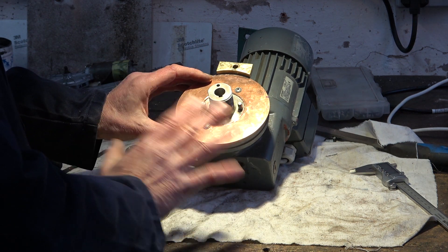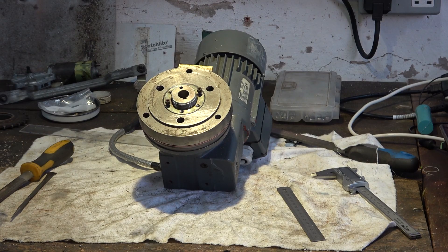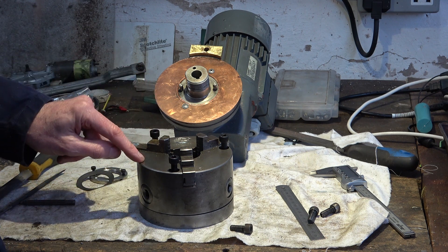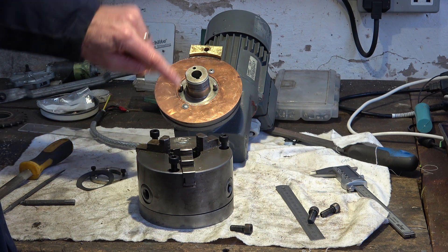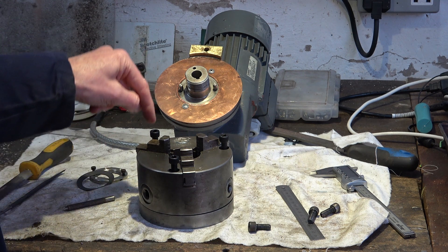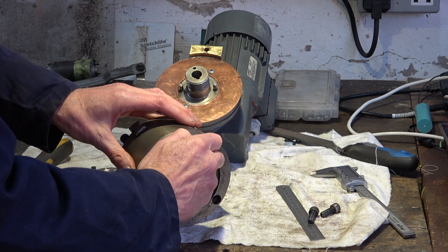That's all now locked together, but I'll assemble it fully later on. The back plate goes on and should clear these two screws — which it does. Time to fix the chuck on. I've got some new cap head screws for this, 75mm long, 8x1.25mm. I've lined up the chuck and the back plate with the two dots, so this jaw is going to be opposite this hole. I'll put these three old screws in the back to clamp the two together before I centre-pop it, then I'm going to try to drill three holes on my indexer — assuming they're exactly 120 degrees apart, which I'm sure they will be — and then tap it with the tapping head.